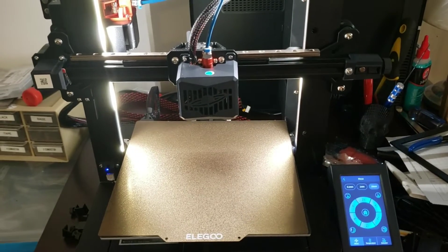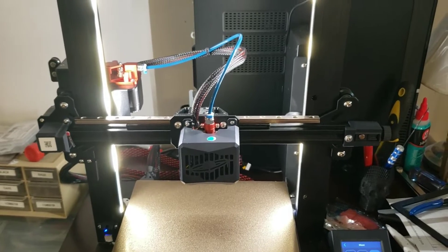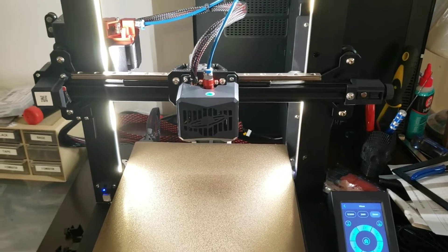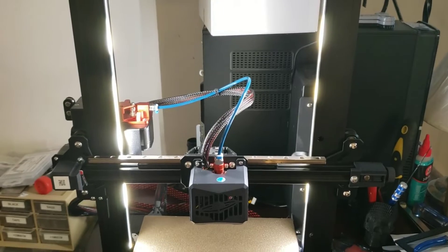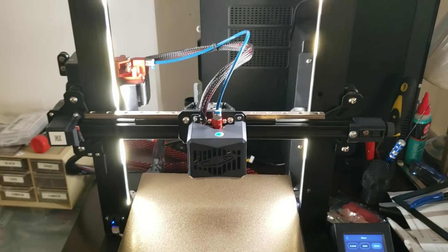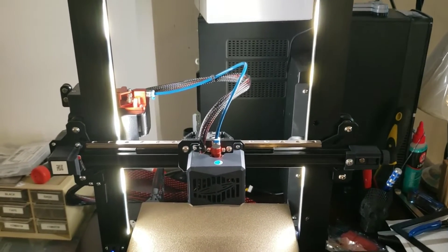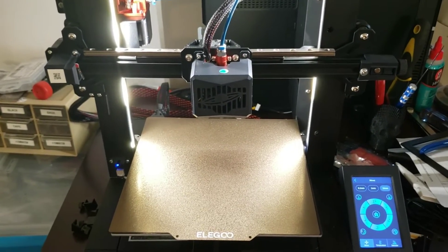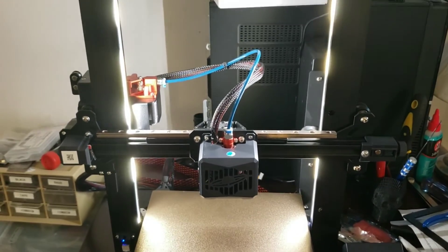The thing cooks — it moves. I did it yesterday. So I'm going to run a benchmark test with and without S12000 and just see how long one takes versus the other. I'll do that with Repetier and report back with the time, because I think it's going to be a lot quicker. The Z still travels at the same speed, but the point-to-point is exponentially faster. So let's do a benchmark on that and see.